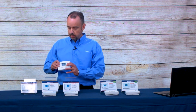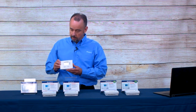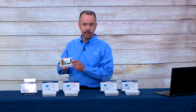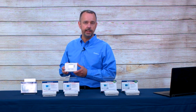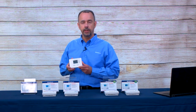You just have fewer features and smaller displays on the Builder Series. Of course you've got the blue backlit display—it's a two-square-inch display, but the characters for room temperature and set temperature are large, so it's still easy to see. For multi-family and rental applications, there's a mechanical jumper in the back that works with installer settings to set a high heat limit and low cool limit. Once the jumper is repositioned and the thermostat is installed, the user cannot adjust those limits, and taking out the batteries will not reset them.